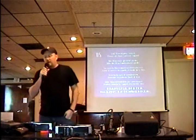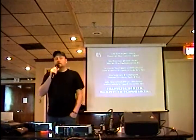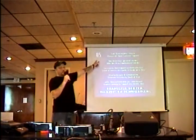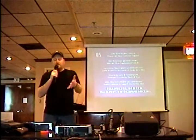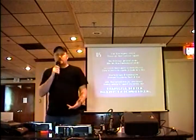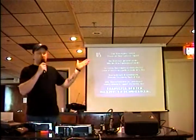I would recommend that you get on Xbox Scene and do a search for Super Fro. Super Fro, that's the guy's name. He has made a list of all of these error codes and what they mean. Error code 5 means that the hard drive is unlocked. Earlier I told you, if you have a hard drive that's retail and in the retail BIOS, it must be locked. So if you want to play Xbox Live, you have to lock the hard drive. Or when you hit your Switch, which you can't even do anymore, you'll get this message. This means unlocked hard drive.